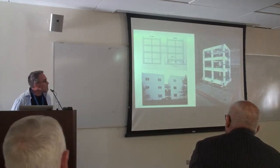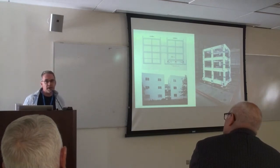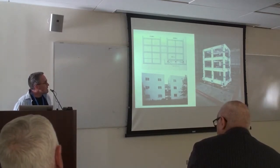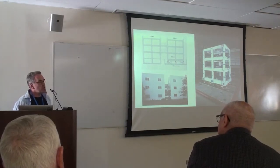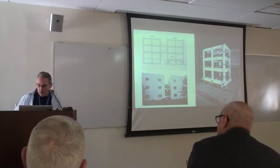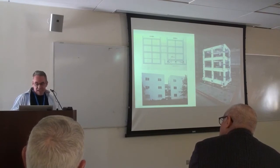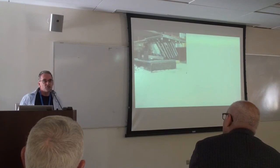The last model I'll show is from the early 90s, done before the shake table was ripped apart and turned into a six-degree-of-freedom table. It was a huge investigation associated with a landmark pair of buildings in Japan. Shimizu Corporation had built two demonstration twin buildings at Tohoku University — one isolated, one not — used as field benchmarks to observe isolated building behaviour in the wild. We built a two-fifths scale model and did extensive tests with different types of isolation systems, also pushing it to the point of significant inelastic behaviour in the reinforced concrete superstructure.